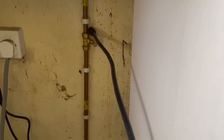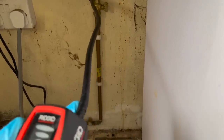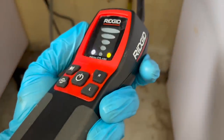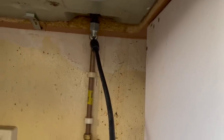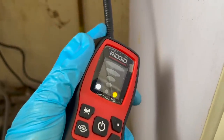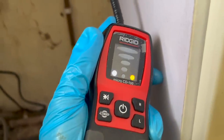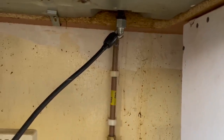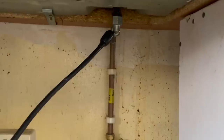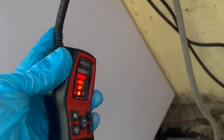I'm going to start at the top of the isolation valve and then make my way from there. Now in terms of sniffers, I feel like you have to be pretty much dead on the leak for it to pick it up sometimes. This is actually where the leak is, and I've got it on the same fitting, but right now it's not picking anything up. But when I change and bend the probe and put it on the left side, now it's picking it up.